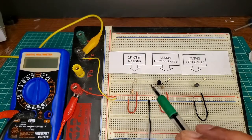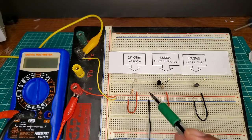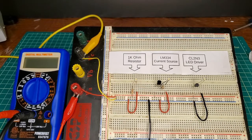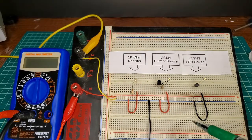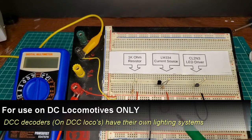Generalizing across LED colors, LEDs can operate between roughly 7–8 milliamperes all the way up to about 20 milliamperes. Most LEDs function very well at 20 milliamperes — keep that in mind as we go further. One important caveat: what I'm demonstrating here is for model layouts running on DC systems — direct current systems. This is not designed for anyone running DCC locomotives.